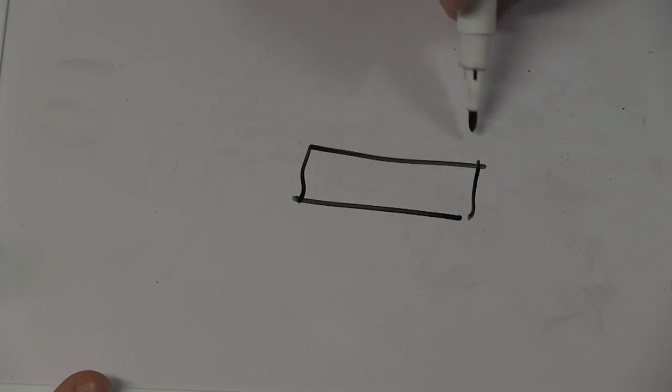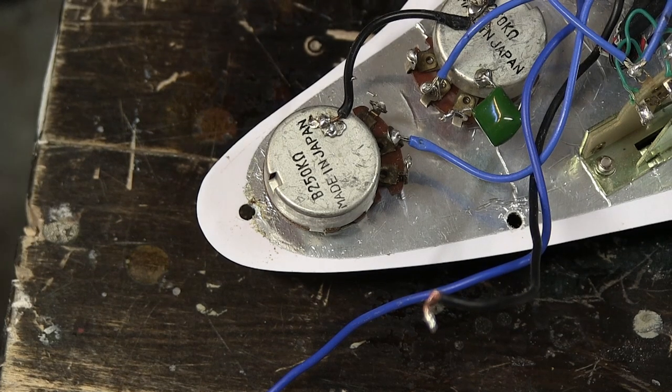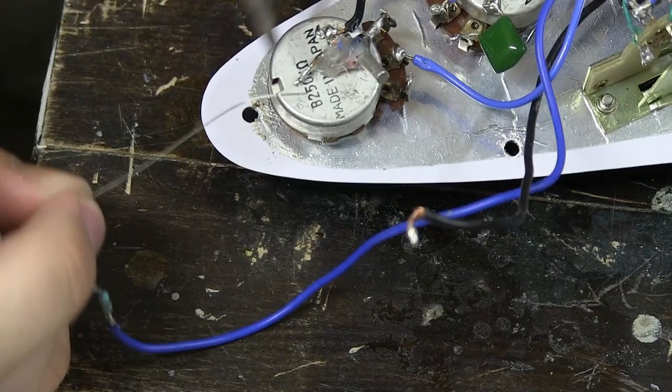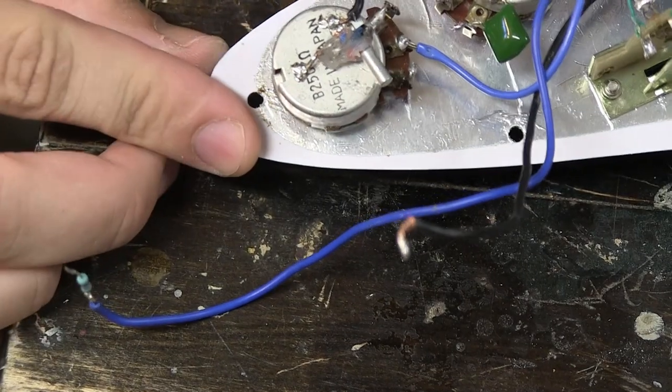I'm going to share an experiment I'm doing here with you. You've seen my SG guitar, and in that the distortion control is just two diodes twisted together. Well, you can also do it like this - and that's the experiment I'm going to try now to see if there is any difference. It's not a difference I'm going to be able to show you; it's more of an experiment for myself. All I've done on this, because it looks wonky, is cover everything in hot glue because I don't want it touching anything else - it's going to be kind of weird and messy to have it in the guitar. I just need to heat this up again, push this in so it gets connected, and then solder it to the back here as well. And now we're basically done with the entire thing.